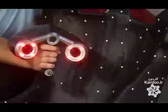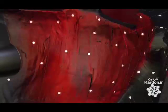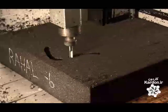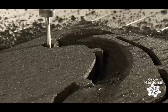The 3D laser scanner reads these reflective dots, which a computer translates into a 3D image. Specialized software then converts this image into a technical drawing, which guides an automated router to cut the seat parts out of polypropylene foam. This precision cutting process takes four to six hours.